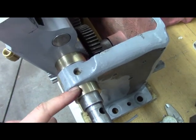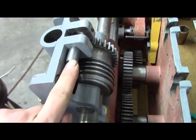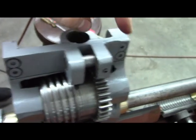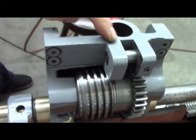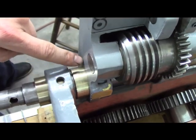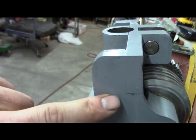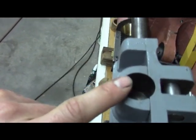But there's been a lot of things done to this rocker box, okay? This piece, you can see, I know, I'm kind of backwards. There's two screws there, and there's two screws there. So this piece was remade at one time, and it was broken out of the casting. And you've seen the brazed repair of the bore. But you can see that this whole handle piece was broke out and added in. And they did such a good job. You can see the seam here.